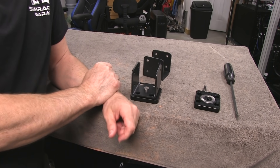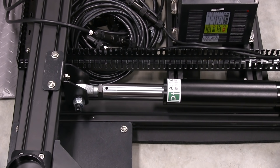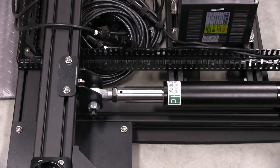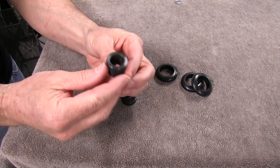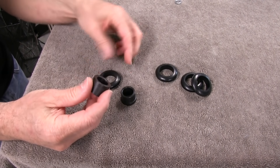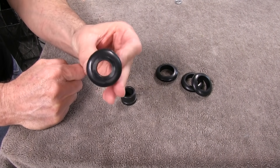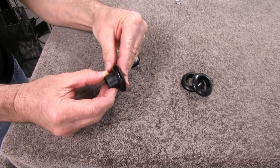We're going to get this mounted. But before I do that, I want to show you another update: some grommets for the rod ends. You can see how the rod end is laying over to the left — once you first start up your actuators it always does that because it's a ball screw assembly inside. PT Actuator came up with a mod: grommets that we're going to put in these spacers. These spacers go into the ball of the rod end, and the grommets fit on the outside of those spacers, sitting flush.